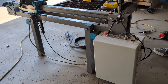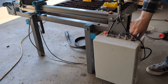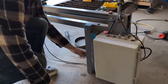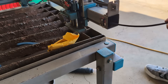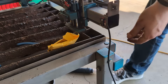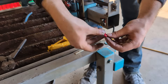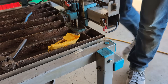The way we like to route the cables: put on the first connector, then plug it into the electrical box where it's going to go. This cable routes down underneath along the Y motor cable, so we get it tie-wrapped into place along it. Where the wire comes out of the X tube and goes to the micro switch, we just cut it to length and crimp on a couple of spade connectors. We're going to put the red on common and the black on normally open.